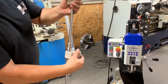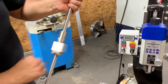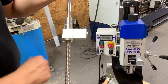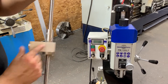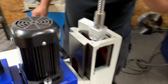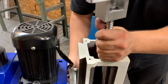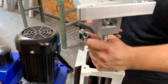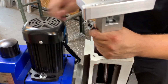Now we're going to put the z-axis on — it's probably the trickiest one simply because you have to find where to slide that boss into the head and you're kind of doing it blind. At least there's a space and you should be able to feel it go into that space. The whole thing will just slide down in here, which is really nice — you don't have to put it in pieces. You can tighten the whole thing down and get it all together, then slide it down in there.